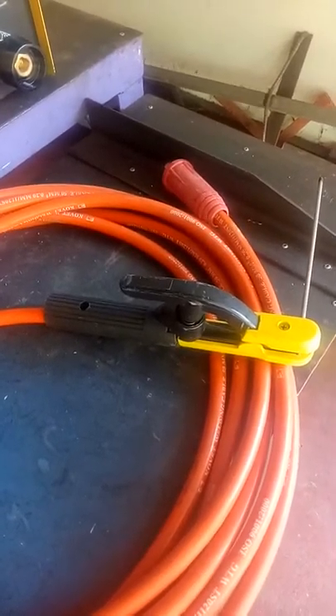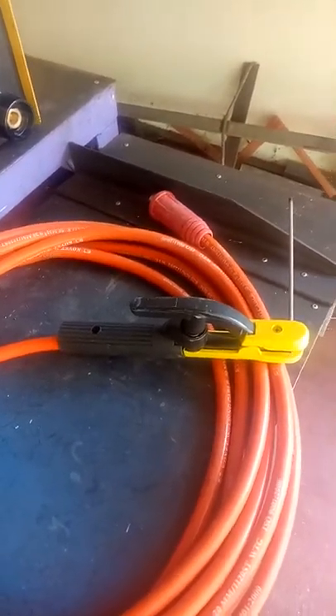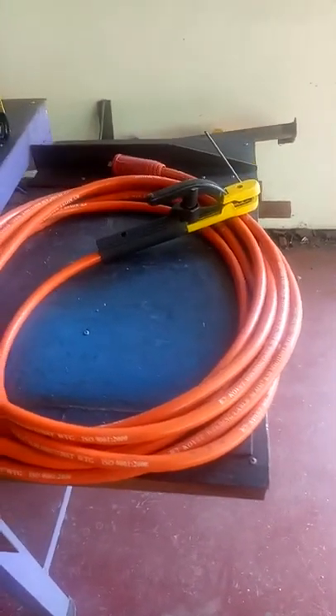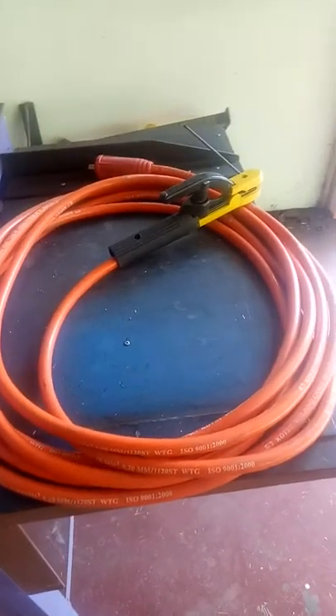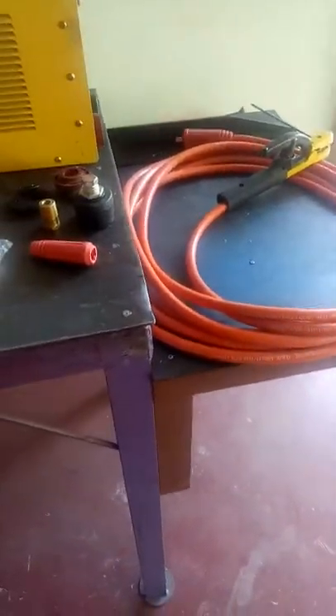But I don't have that - it's only a 200 amp welder. It can still run 4 millimeter rods, but you just can't run two in a row. It's just not possible with the heat - the machine just can't handle it.